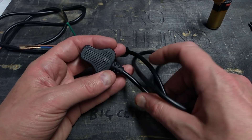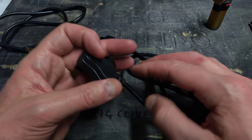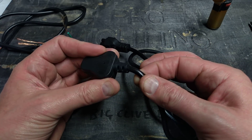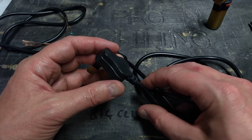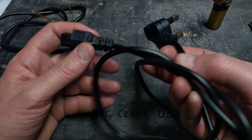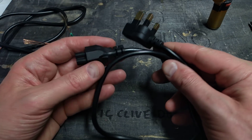If you're in other countries, feel the cable, and if it comes to it cut the end off to re-terminate it and check the cable. If the cable isn't copper, save yourself a load of hassle and go get from a local supplier a proper lead that fits your local regulations in your country, because it will save a lot of trouble in the long run — and that includes burning your house down.